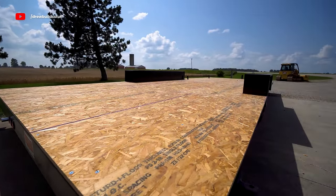Couple things to note, you obviously want to start at the bottom and work your layers up so that it's layered properly to shed water. And for any corners, I just make a cut like this, and then patch on another piece. I'd also leave enough excess to stick it 3 or 4 inches up the wall like it is here.